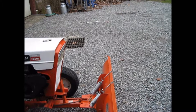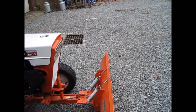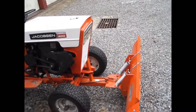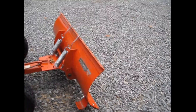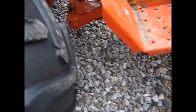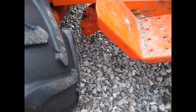A little bit about the snow plow — it is a spring trip plow, so it trips when you hit obstacles. Those springs are not the original springs, but the original springs are very rare to find in good condition, so I just kind of rigged that up there. And here are the shoes. I got it set a little high because my driveway is gravel. The only thing I don't like about this plow is that it has this long frame that runs under the tractor all the way back to the transmission, so it kind of hurts the ground clearance a little.